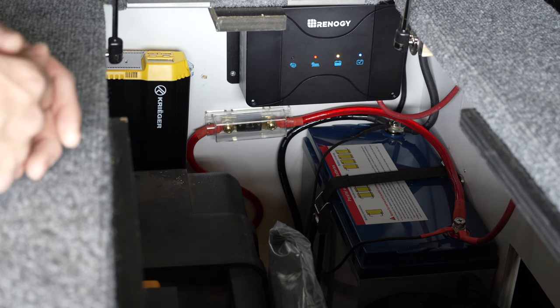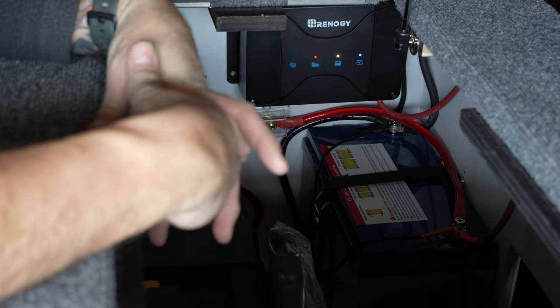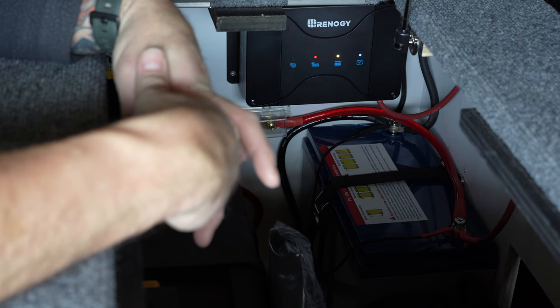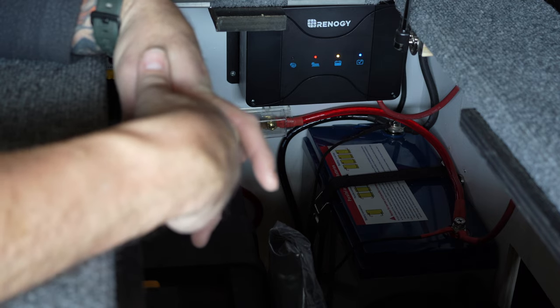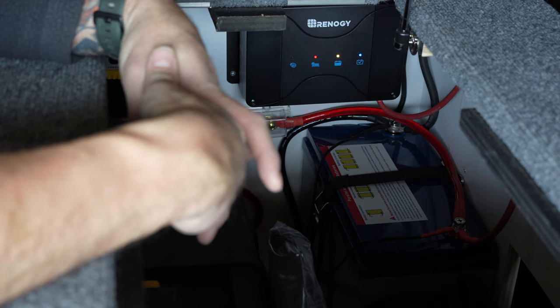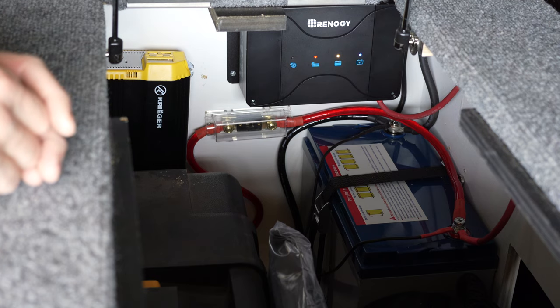It's totally expandable — I could buy another battery right now, drop it in next to this one, and I'd have 200 amp-hours. Those all-in-one units are great and I do love them, but they're not expandable and they charge a pretty penny. A 100-amp all-in-one is not cheap and not expandable. Charging isn't as quick either — a lot of them you can't hook directly to the alternator, and combining alternator charging with solar requires a really good unit. They are convenient though. That's the setup right now, it's working great — throw any questions in the comments and I'll see you in the next video.